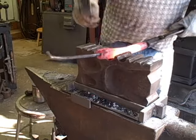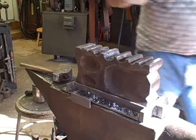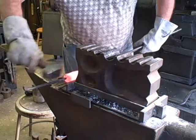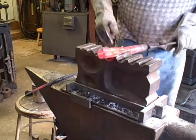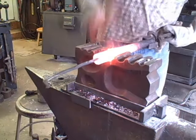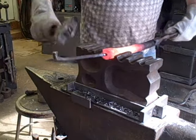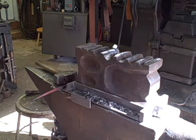The wrought iron that I'm using is extremely high quality. Most modern smiths — hobbyists especially — believe that wagon tires are always poor wrought iron. I can assure you that many are not. I have lots of them, and probably one out of five end up being very good wrought iron; this wrought iron happened to be exceptional. You can see I'm closing up — it takes many, many heats to do this. Making a barrel this way, rather than just trying to drill a hole in a long solid stock, makes the barrel stronger.